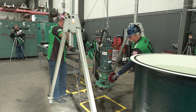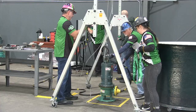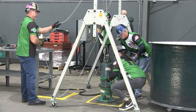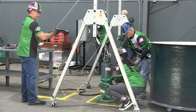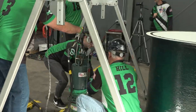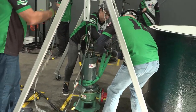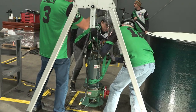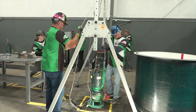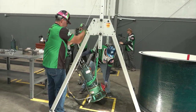Lower the pump to the floor in the vertical position in the marked box. Slightly lower the chain hoist and remove from the pump lift bail. Using the provided lifting sling, choke the sling securely around the motor at the bottom bracket. Do not trap the electrical cord in the sling. If the lifting sling is installed incorrectly, the judge will notify the team member to properly secure the sling — choking the sling tight is of the utmost importance.